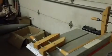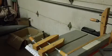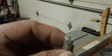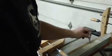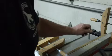Okay, now the blade width ain't exactly big enough. This was a lot bigger when I started, but I had to get that perfect slice. The blade width is almost the exact same width as that wire I'm using, so I need to get a little bit fatter. What I've got to do is clamp this in here, cut half of it, turn it around exactly in half, and cut the other side.